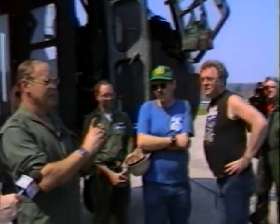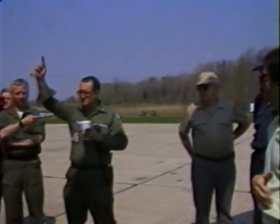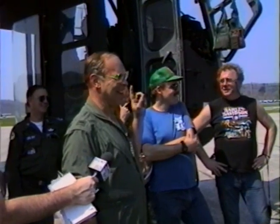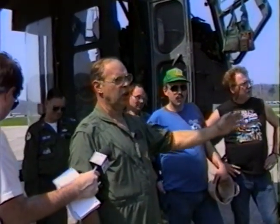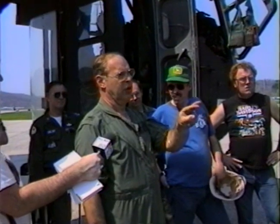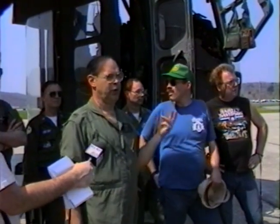I'm going to need six or eight people — the more the merrier, but not too many — to work the load up on the hill. And who's in charge of that group? Not to be insulting, I need eight strong guys and one smart one. He's going to be in charge, and what he says goes up there, because that's the hard part of this job. You've got two jobs: first, help guide the container onto the pilings; and second, unhook the slings after it's set down. You're also going to have to do a hook-up when we come back.